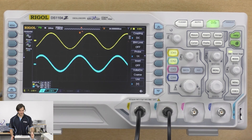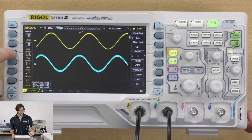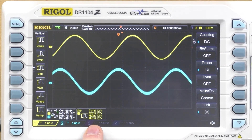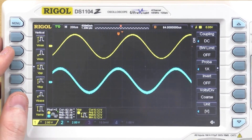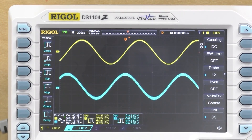I can switch over to the vertical menu and measure the voltage peak to peak. I'll select channel 1 and hit the voltage peak-to-peak option. You might notice that the color of the text has changed on this menu — that's a nice visual prompt to show what channel you're measuring. Selecting the voltage peak-to-peak measurement brings up a window, and in statistic mode we get time statistics as well. Selecting channel 2 gives another measurement window, with different colored text and channel labels to make it very clear which channel each measurement corresponds to.